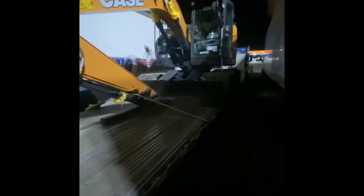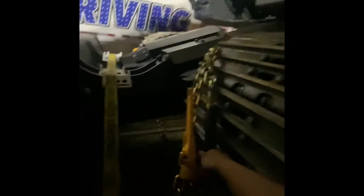Another thing: this is considered heavy equipment because it weighs 10,001 pounds or more and it's on tracks or wheels. For heavy equipment, you are required to put a chain on each corner — so four corners, four chains: one, two, three, and four. Those four chains also factor into the 50% minimum securement. At 3,300 pounds each, that's 13,200 pounds, and then I needed to add more chains until I reached at least 20,000 pounds — which is the reason I added the other four chains.